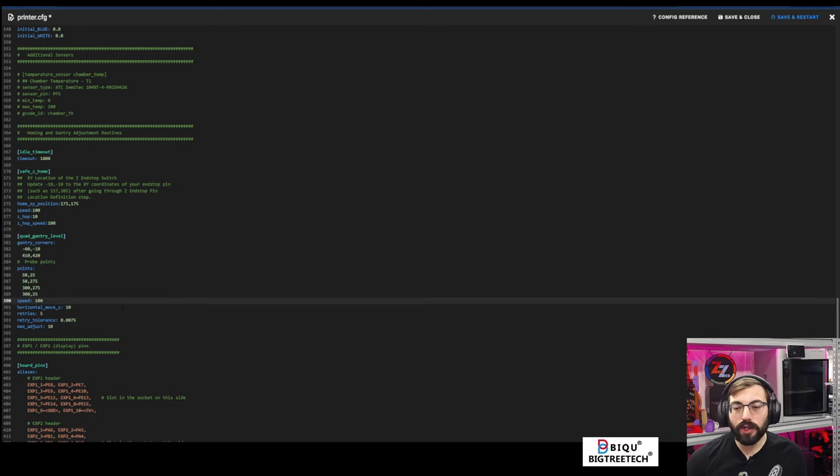Let's do the same test — run a bed mesh and see how it looks. I haven't fully calibrated my Z offset, I just got it close enough with Beacon. Typically for all my beds I use Maker's Mistress. Maker's Mistress is a bed adhesive product by West3D — it's essentially a liquid glue stick combined with isopropyl alcohol. You apply it on your bed; once the alcohol evaporates you're left with a glue stick. Parts tend to stick better, especially small parts. And if you applied too much and it leaves white residue, you can hit it with a heat gun and it'll just evaporate.